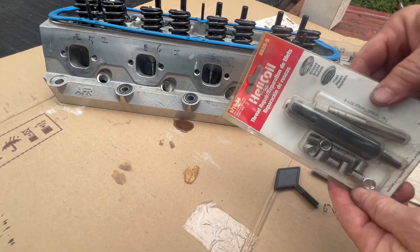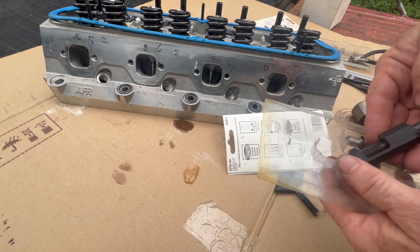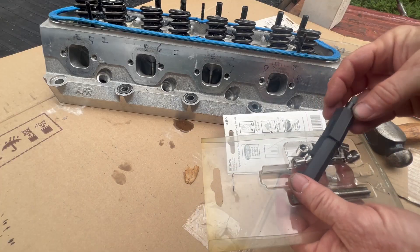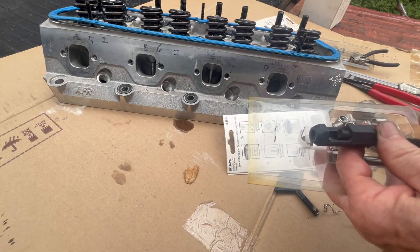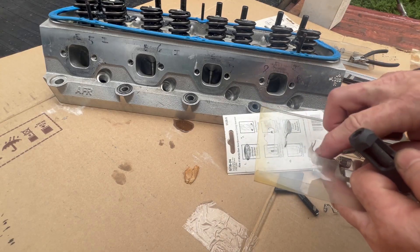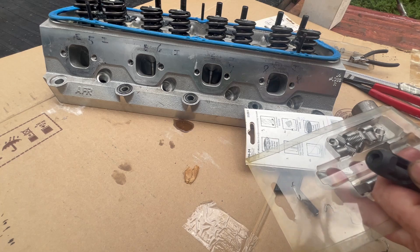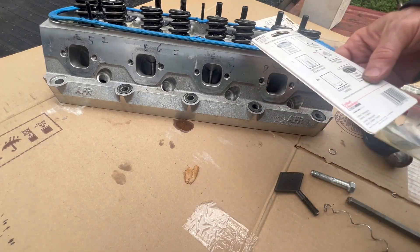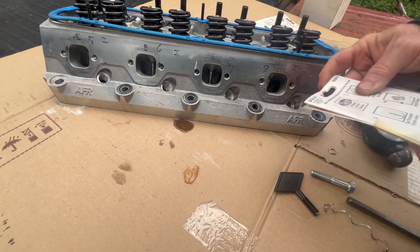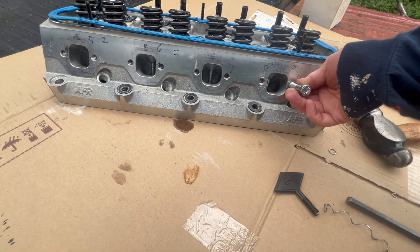There are different types of tools and different methods for some of these different helicoils. Looks like I had to modify this one for some reason to fit in a tight space. Here's one where you load it in here, put this flat on the surface, and thread it in — it's 5/16-24. You need to make sure you're familiar with each one; look them over as to how to use them. They are lifesavers. I worked in aviation, and everything that's aluminum in aviation has a steel insert — you would never, ever, ever put a steel bolt into an aluminum threaded hole.